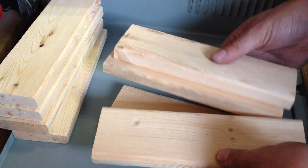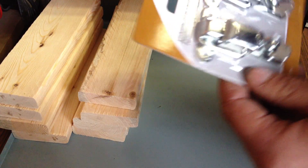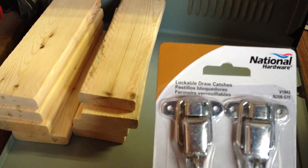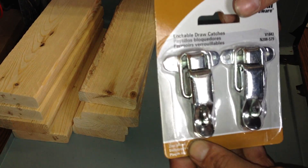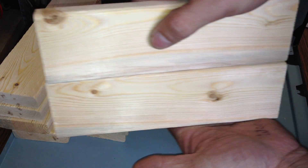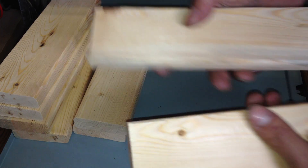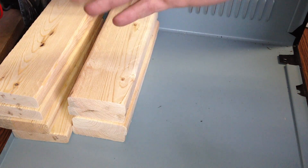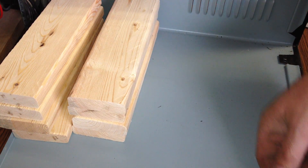I've got eight pieces here. Another part you're going to need is these little lockable draw clasps. Once you're ready, you'll be able to lock the two portions of the box together, keep them sturdy and still so your part stays sanded and the part stays intact while you're pouring your aluminum — or whatever metal you're going to decide. Aluminum is just the most convenient for me, as I've got probably about 500 pounds of scrap aluminum, nice and clean, from scooter engine blocks and whatnot.